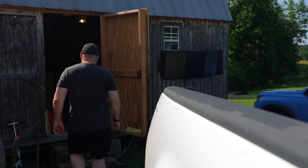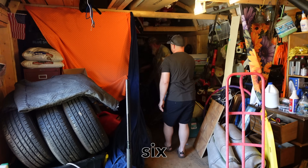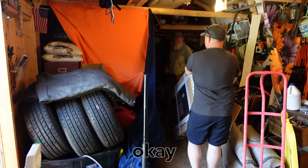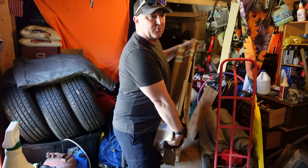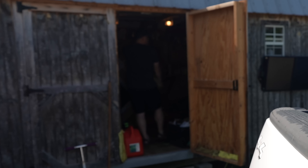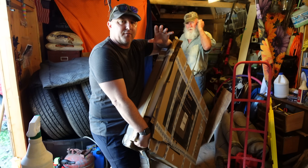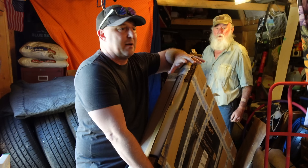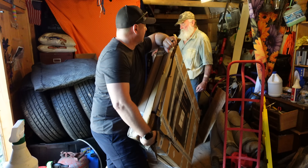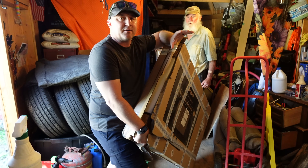Steve, how many solar panels do we have today? One, two, three, four. We're going to use the four panels that are the same for this setup — we want to use similar solar panels because he's got several random panels for that Mango Power E. We want to make sure that the voltage is the correct voltage, and we're going to do a two-series, two-parallel setup so that with the four panels we get very close to 1000 watts of input.